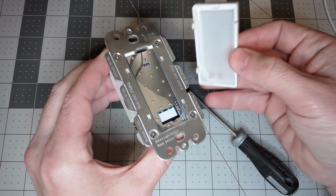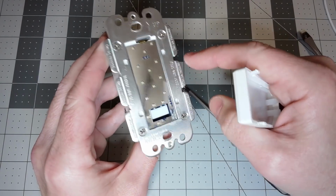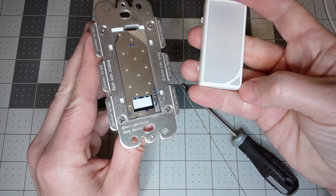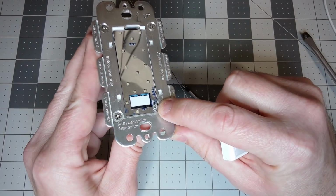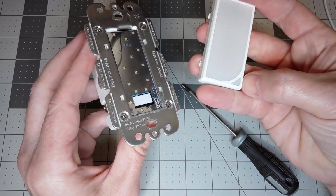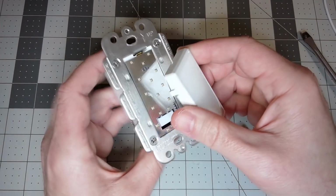So it's just a little diffuser here with the two little buttons that push it. And these are all LEDs behind here, the multicolor LEDs, and they're just PWM, so you can set whatever color you want, combination, etc. And if you look down here, which goes in with this little triangle looking diffuser piece, there's actually three LEDs down here, your red, blue, and green. So you can go ahead and set a red, blue, and green to this bottom piece as well. So you get six different LEDs on this thing, plus the regular relay. So you can do a lot of cool stuff with it.